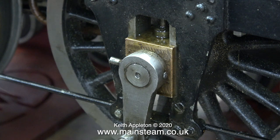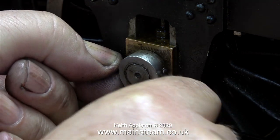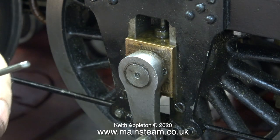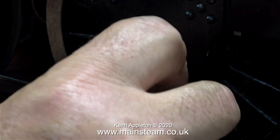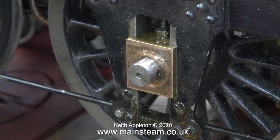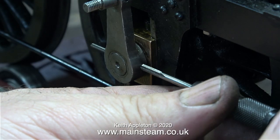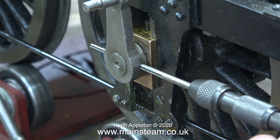Hopefully I will live long enough to fix all of these problems at a future time, but as I mentioned earlier I am quite busy at the moment. I'm very carefully tapping out the taper pin — there it goes — and here, with very little effort because it's loose anyway, I'm removing the crank web from the crankshaft. What I'm going to do, with the help of a taper reamer, is ream the hole through both the crank web and the crankshaft a little bit deeper.